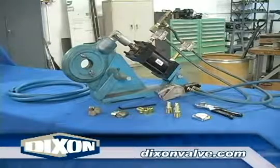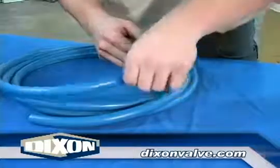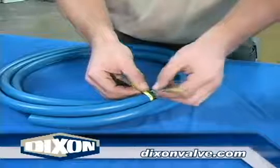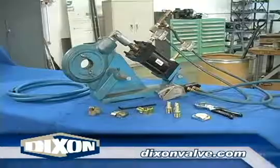Prepare the hose using procedure 1100, general preparation instructions. Measure the hose outside diameter with a diameter tape. For proper ferrule and die selection, please refer to procedure 1103 to set up the 5111A/1765A crimping machine.